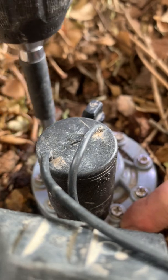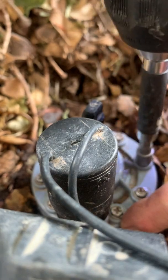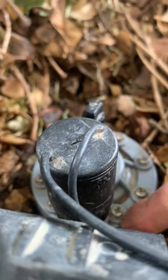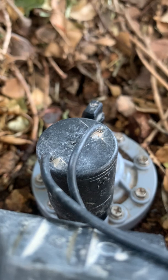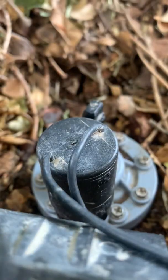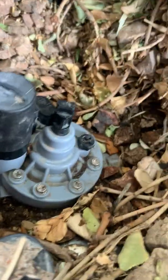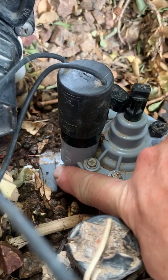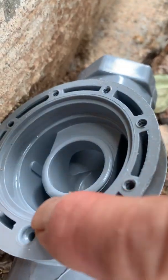Now I'm going to go all the way around just to make sure I didn't miss any, because I think I did. Okay, so now what we're going to do is turn the water on and see if this leaks. It's looking good right now. We've turned the water on — you can hear it running and water is running through the valve and there's no leak at the base of the solenoid. We've made it better with that little o-ring that came out from the recess on the old valve body.